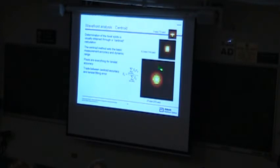But we really want that information at much less than 1 pixel resolution. We want the information to be a small fraction of that. And we've got quite a bit of information about this focal spot. There's some things here which confuse us, like these side lobes you can see. The exact arrangement of those is going to depend a little bit on the side lobes of the one next to it and how close they are together. So you really want to filter those out. But there's some really simple ways to do that.